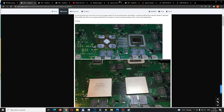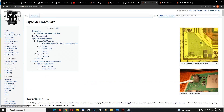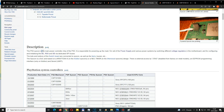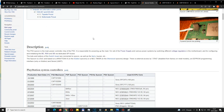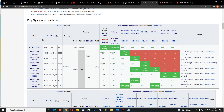It turned out there were quite a few more components that needed to be either replaced or modified. The second most important component after the GPU chip was the syscon chip. This is meant for developers, but basically the syscon chip is the main power controller chip — it's probably the most important chip on the whole motherboard because it controls voltages and allows communication between different components. You can see all the syscon variants used on the fat PS3 modules, and the COK-001 is exactly the same as what was posted in the picture.